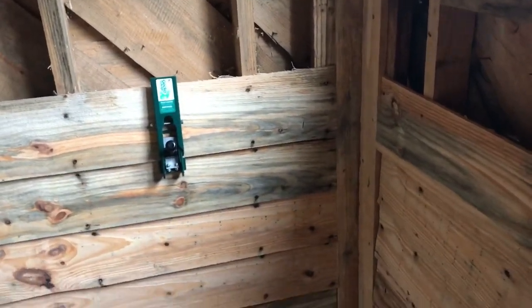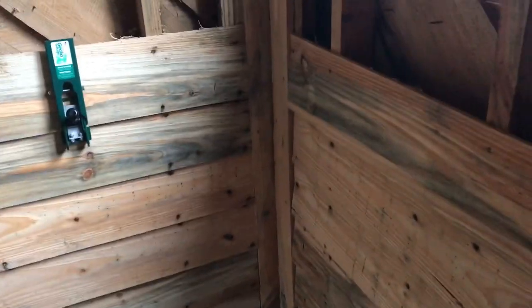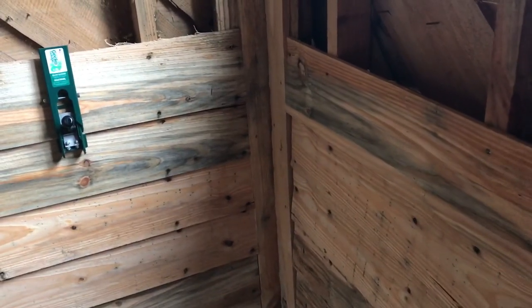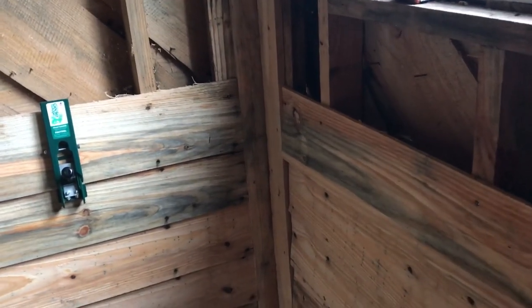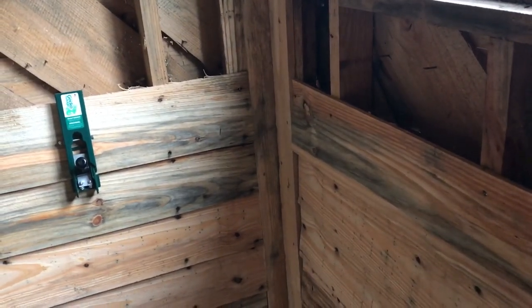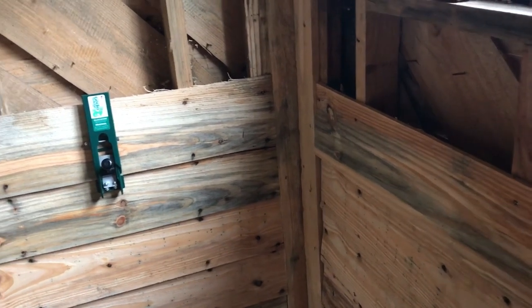The building isn't waterproofed exceptionally great, so I didn't want to fool with vapor barrier, insulation, all that, wanting to cause mold issues. It's easier just to let it breathe in this case. Anyway, we'll end up taking the wall board all the way up. For right now, I'm stopping at about 4 feet because we're going to go ahead and run some electrical. Don't know if we'll ever hook it up, but we'll go ahead and install the boxes, run the wires, just that way we've got an option. Get that done, and then we'll go ahead and close the walls all the way up.